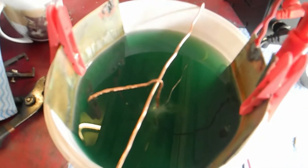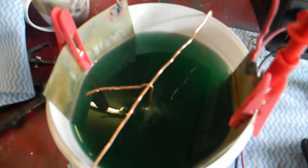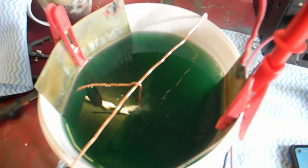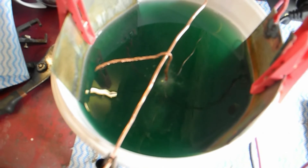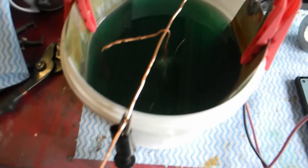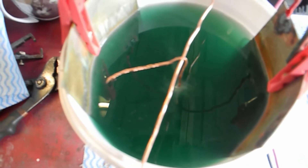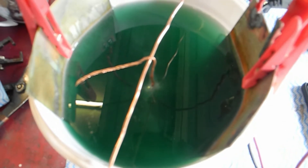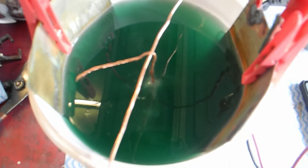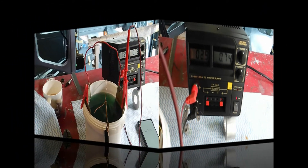The question now is how long do I leave it there. I'll start a clock and we'll have a look at the three-minute mark. Just to recap: negative goes to the item you need to plate, positive goes to the plates on the side in the suspension liquid which is the green color, and I've got 2.9 volts.